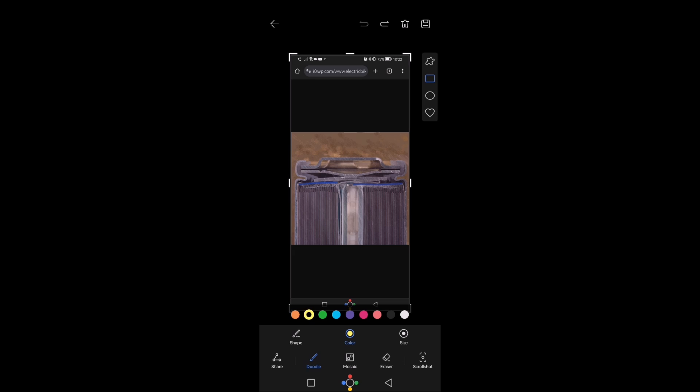There's also an insulator ring on all the sides. That's a different function — this is an insulator for overcurrent. If you exceed and draw more than this battery should be able to give you, it will stop conducting or at least greatly lower its conduction. So that's a different safety feature for overcurrent. This one is for overheating, over-pressure, whatever you want to call it.